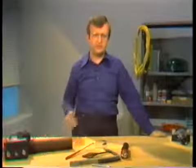Now that you're familiar with some of the problems to look for during water wall inspection, let's discuss how you find them. We'll go over some inspection procedures and why they're needed. Boiler inspection actually starts before you enter the boiler. Listening for leaks, for example, is part of that pre-entry inspection. Most of the inspection, though, takes place after the boiler has cooled down and you can get inside. Once inside the boiler, you can determine the exact location of leaks identified during your pre-entry inspection.